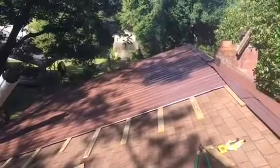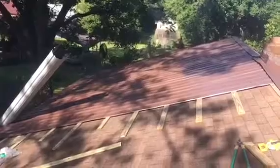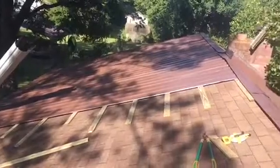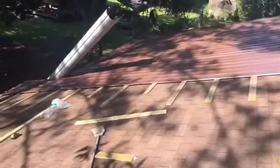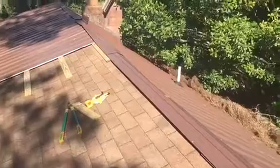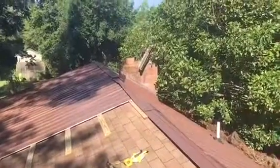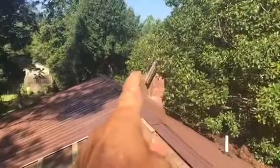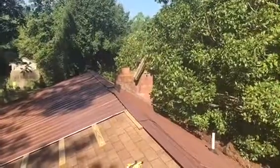We're back here in the morning, hopefully to beat the heat a little bit. We're almost pretty close to halfway — sheet-wise I think we're halfway. We're running the boards across, screwing everything down, putting the metal on, trying to clean the other side of this roof up. We'll go over the chimney flashing again while we're here. We're probably even going to clean the chimney out while we're here from the wood stove. One of them on the backside hidden by the brush is for the hot water heater, and that one there is for the wood stove.